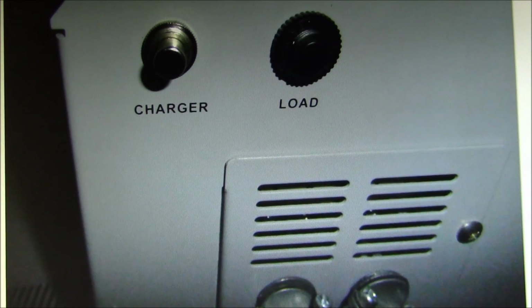It operates at the power line frequency and also directly off the battery voltage. This differs from inverters that take the battery voltage and boost it up to a higher level at a higher frequency. Higher frequency and higher voltage both are key to increasing the efficiency in the inverter. With higher frequency, transformers can be smaller, and with higher voltage, the output switching components handle less current.